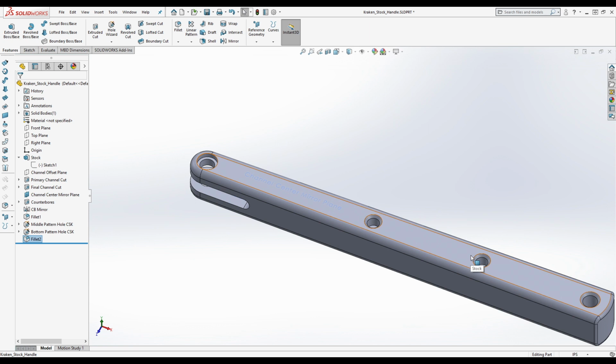All right, remaining things. So we got the jimping on the sides, and there's a slot that he does down here. Now the question is, what radius tool or what diameter tool did he use to do this slot, this little ball nose kind of slotting cut that he did down the center of the handles? My guess is 1/8 of an inch, just looking at it. That could be incorrect, okay?